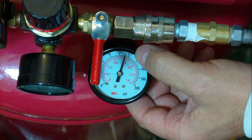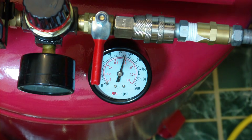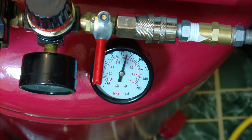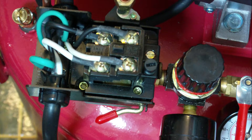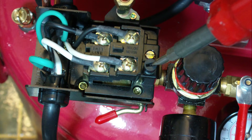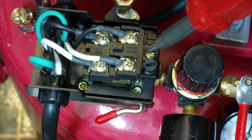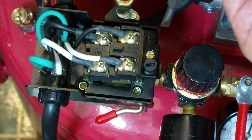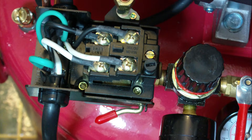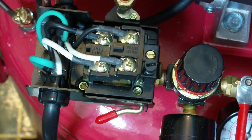It's two marks under 120, so it's about 112 PSI, and I turned that screw about one full turn — the little metal screw. I actually had it about a quarter turn higher than that before the demonstration. This is the inside of the pressure switch, and this black plastic screw — I wouldn't mess with that one unless your cutting pressure is really high. But this metal screw right here: turn it clockwise to raise the pressure, counter-clockwise to lower it. I would start with a half a turn unless your pressure is really close to 115. When I first bought this machine it was 105, and I had to put in about one and a quarter turns to get it to the pressure I need. The safety valve over here is blowing at 125, so you want to make sure you don't turn it past 120.